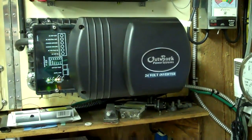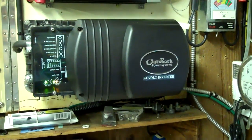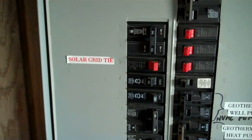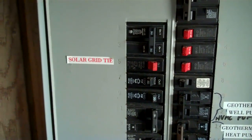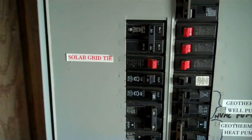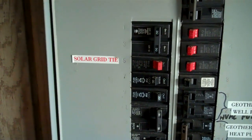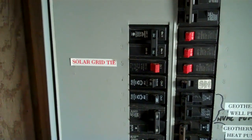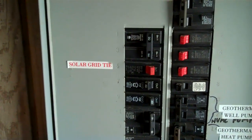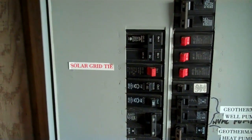Probably the easiest way is to start from the beginning, where it starts and where it ends up. The connection going into the inverter, or the AC in, is this 30 amp breaker, which goes to number 8 wire because the run is so long. It's 120 volt input, so it's a single pole breaker. You just have a hot and then your neutrals and your grounds are tied to the bus bars.